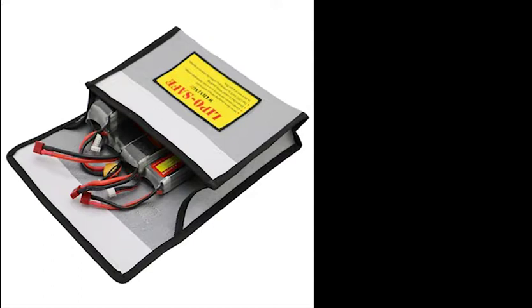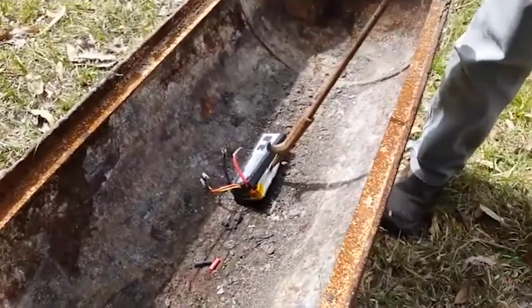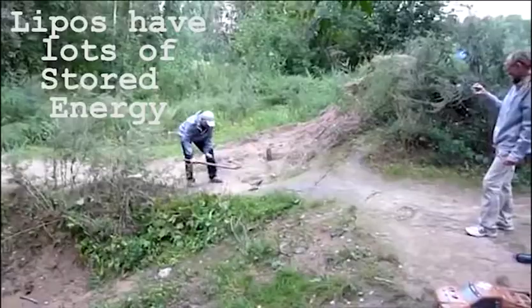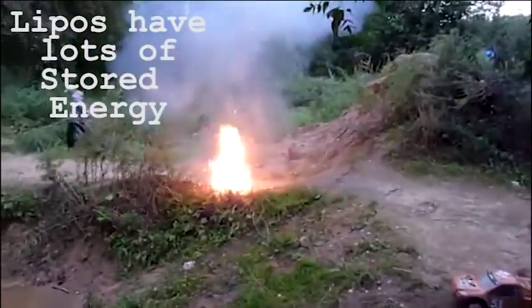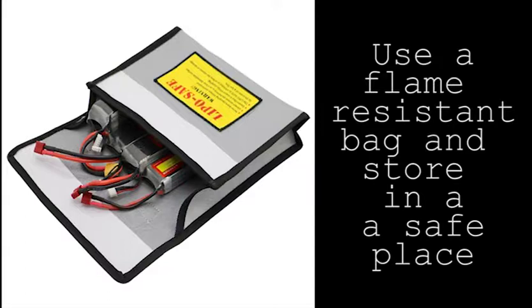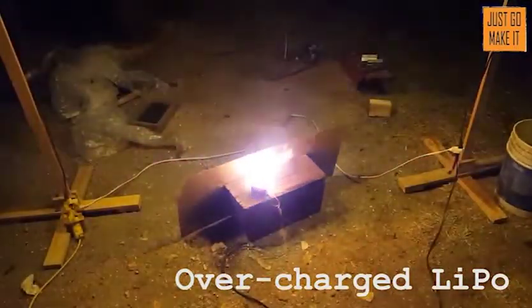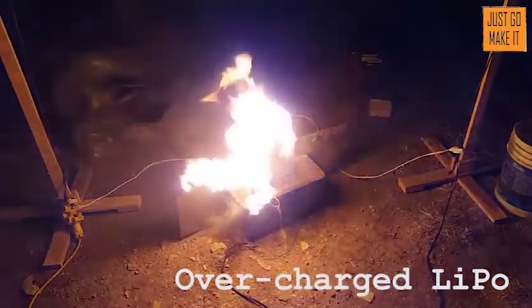We're also going to be using LiPo batteries, and there is some risk involved. They can puff up and burst into flames if they are not used correctly. You always want to be mindful of them. If you've got a safe place like a lockbox that's flameproof, or a flame-resistant bag, that's always good. You also want to keep LiPos within certain voltage ranges — you don't want to overcharge or undercharge them, as both of those things can cause them to fail.